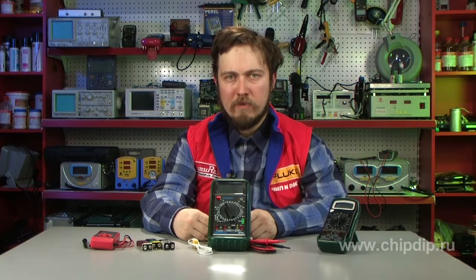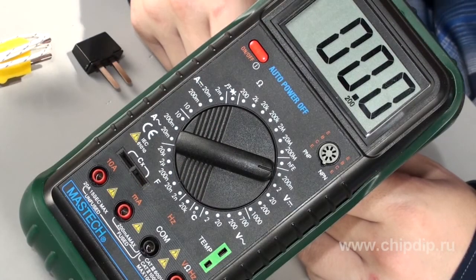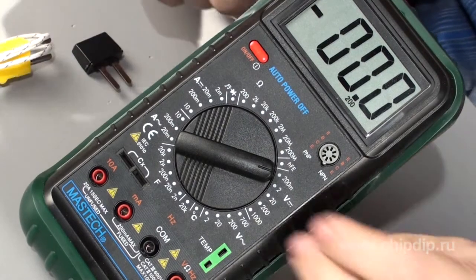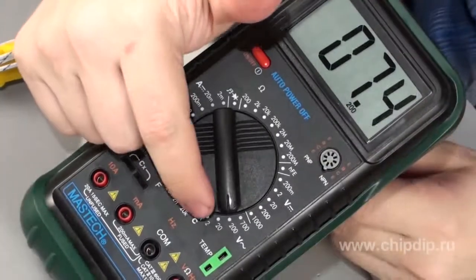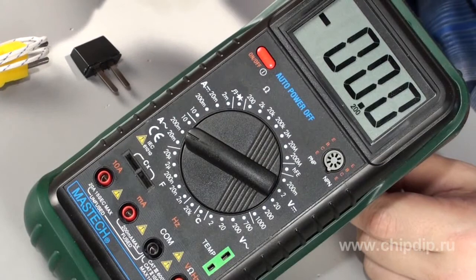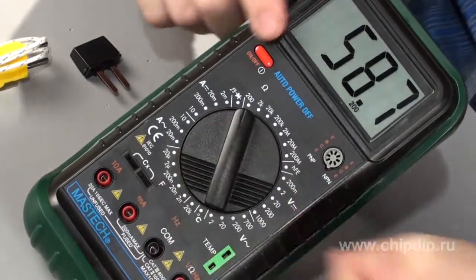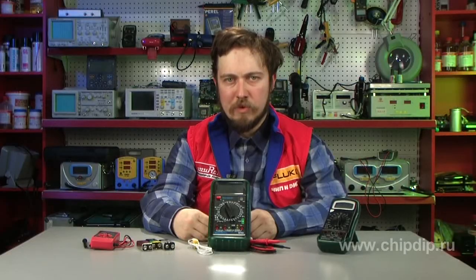To select a best fitted device, one needs to consider the number of functions and measurement ranges. The key functions and desired ranges would be as follows: DC voltage measurement 2mV–600V; direct current measurement 2mA to 10A; AC voltage measurement 1 to 700V; alternating current measurement 20mA to 10A; resistance measurement 100Ω to 10MΩ; plus the wire identification function.